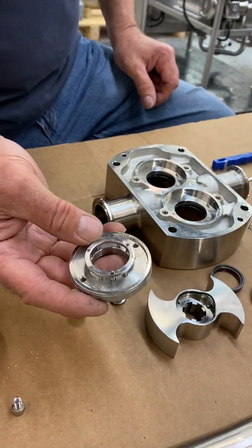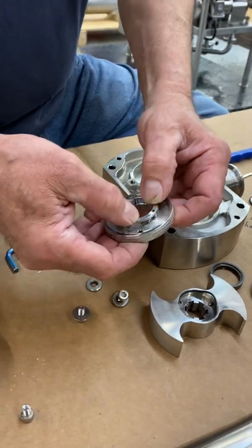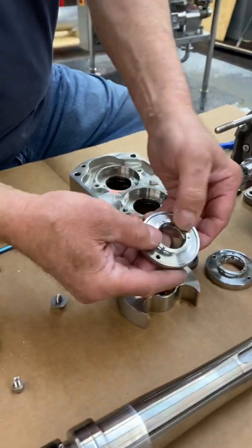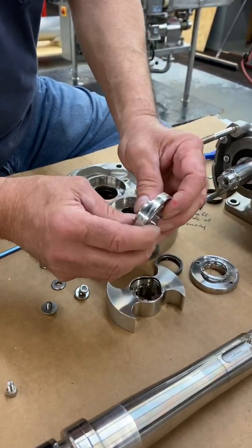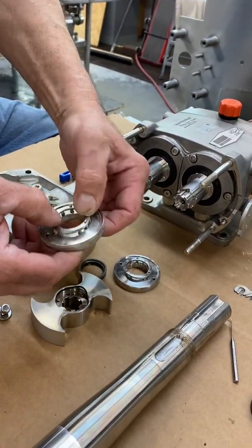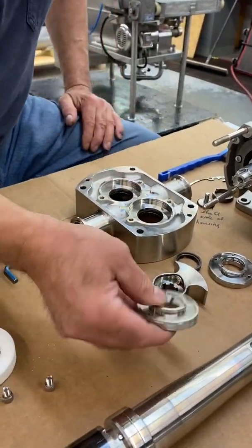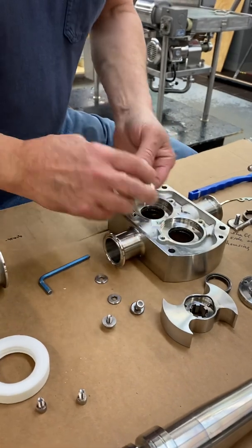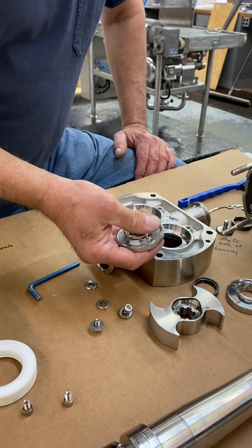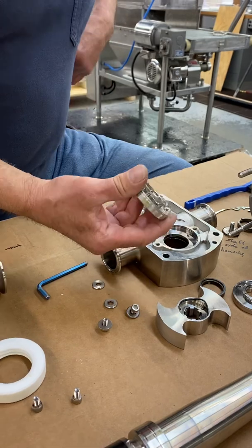What are some things on a single mechanical seal that are some issues in your opinion? You'll see some debris build up in there, and these little springs, they'll catch the debris, and over time, if you're not doing proper PM on this, these springs will seize, they won't compress, making your seal pretty much not work properly. Gotcha. And if you're running a thicker viscosity, depending on what you're mixing, using it for a mixing pump, sometimes what we've noticed is that it has a tendency to pop that seal as well.